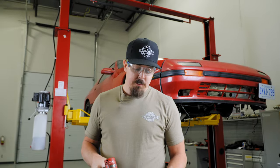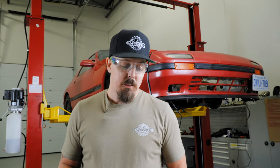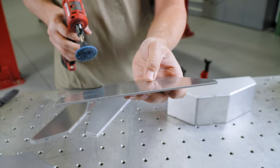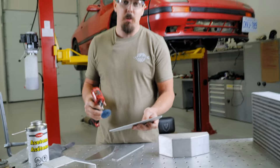I like to take off that little bit of a laser burr on the edge of these parts, because they tend to burn into the weld pool just a little bit. So I like to have my aluminum welds extra crispy with that ultra fine edge. You need a real light Scotch-Brite wheel and you just barely hit it, acetone wipe down, get to welding, no problems.